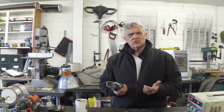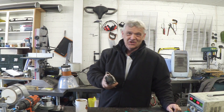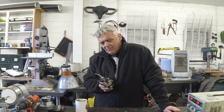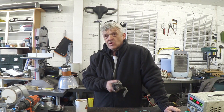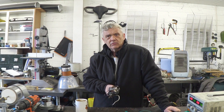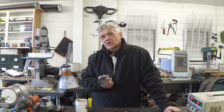There are issues with universal motors - their speed control is rubbish, which is why you find them in vacuum cleaners because they've only got one speed: fast. However, when you want to make a generator out of them, you've got to remember that the electromotive force E is equal to BLV sine theta - at least that's the way I remember it. B is the strength of the field, L is the length of the wire, V is the velocity at which it turns, and sine theta is the angle of the wire to the field. Velocity clearly has a huge impact on what these can do.